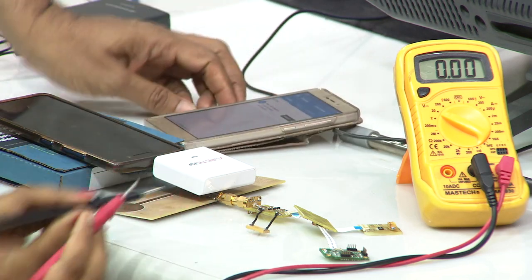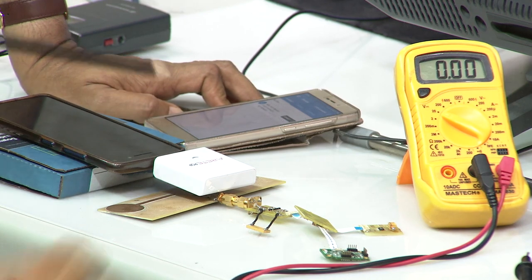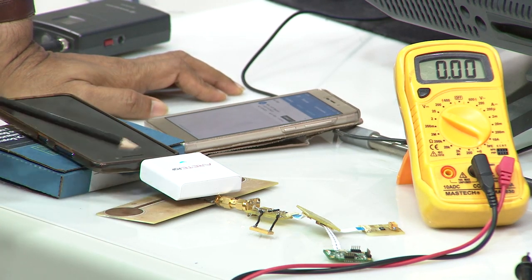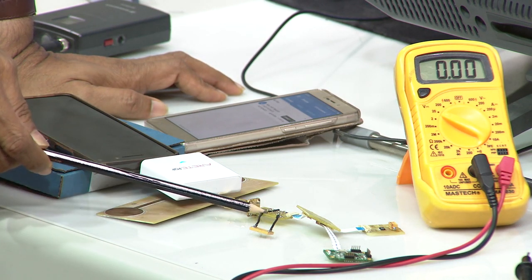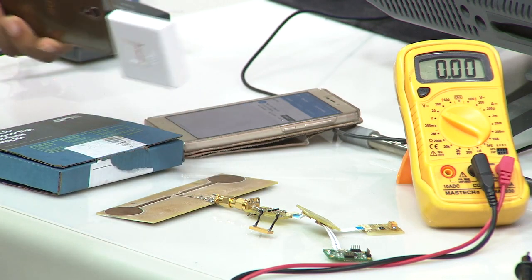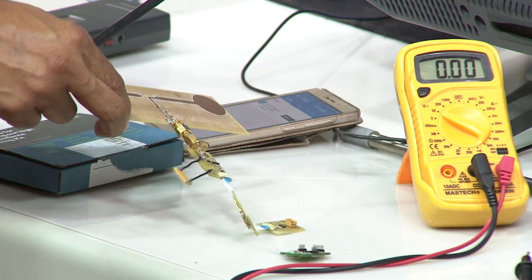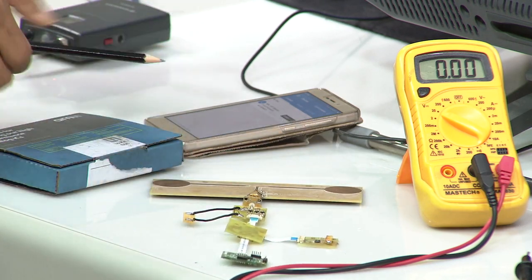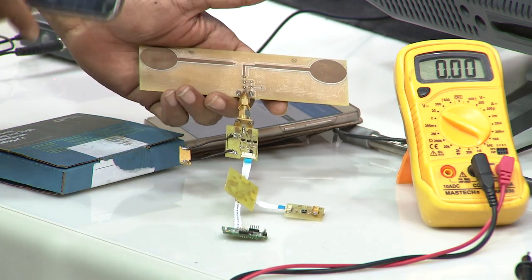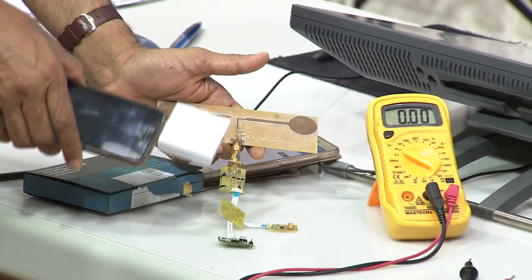So what is the summary of this experiment? The summary is that if you have a sensor node with RFID and a sensor connected to this board, and it does not have any battery, you can come with a handheld reader like this and power this sensor node. Now that the demo is over, this is just a lab demonstration setup which makes things a little more modular. That is why we have a passive board which connects this. So you could essentially come, with this being your electronics and the sensor, periodically and try to read the sensor value through that.